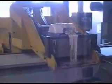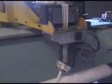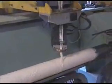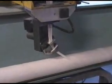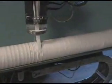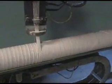We've got one layer of glass being wound at 45-degree angles, and then we're going to follow it up with what's called a hoop layer, where the strands are laid down side by side. This gives a smoother finish and a better burst strength.